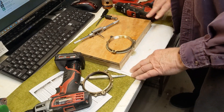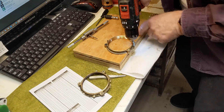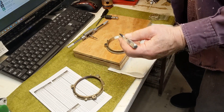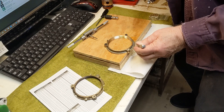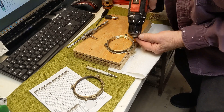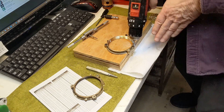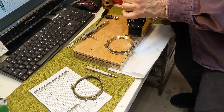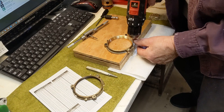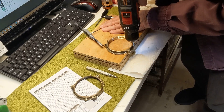I'm going to show what I was doing. I put a couple screws in there to hold this down. This hole is a little off — when I used the punch, the starter hole was a little bit to one side, and I don't want to drill it that close to the edge. To get it started, I basically angled the drill toward where I wanted to move it. Now I've got the hole started right in the center where I wanted it, and it looks pretty good.